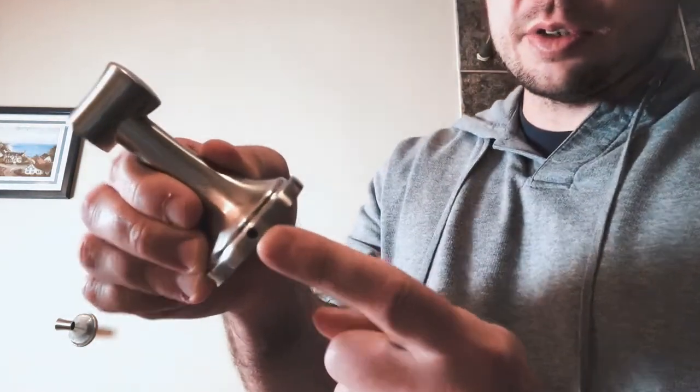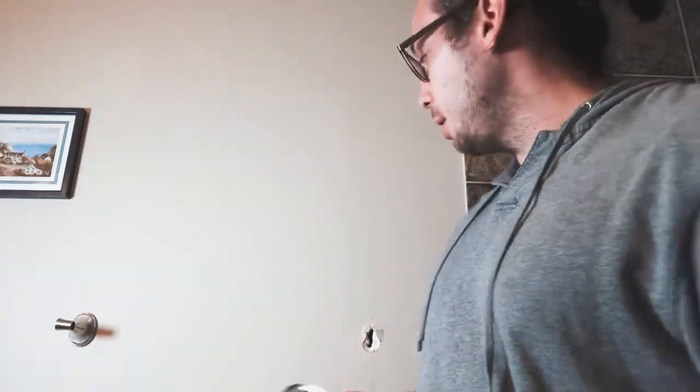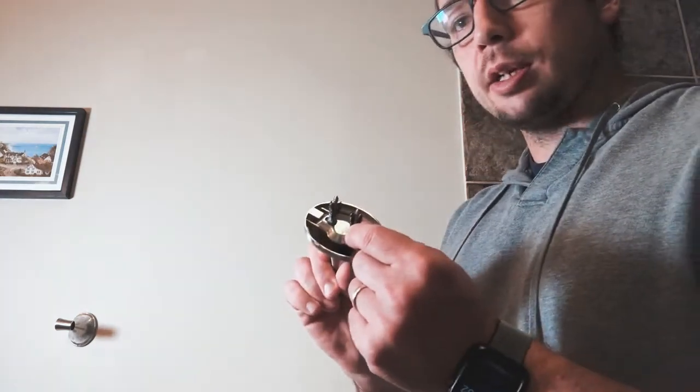If you've got a broken towel rod holder, towel rack, a lot of times you'll have the little hex that comes loose in the bottom, but in this case you can see the mount here in the wall has come out completely. There are two screws that hold this one into little plastic sheetrock screw holders. What I'm going to do is repair the hole by putting new sheetrock mud, letting it harden, and then re-drill the holes and put new plastic screw holders in there.